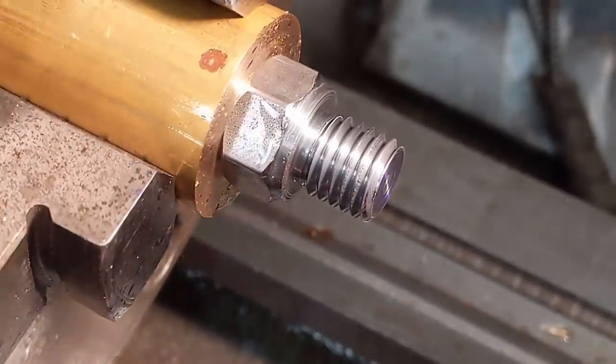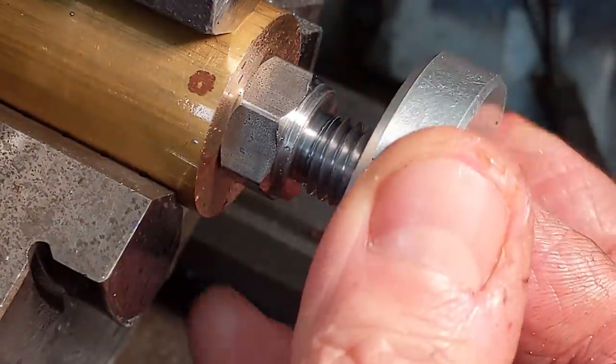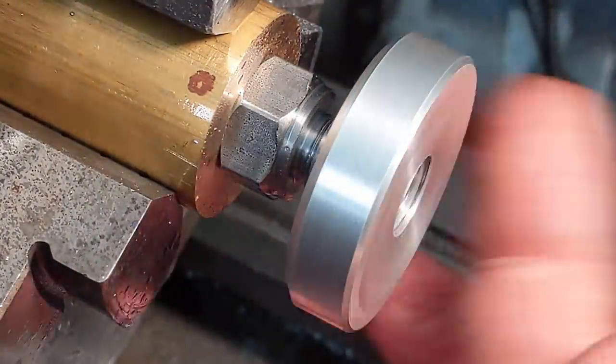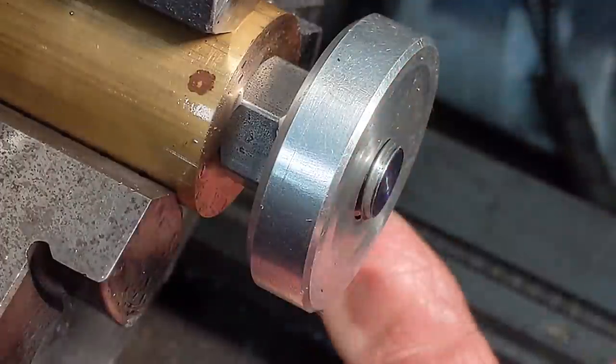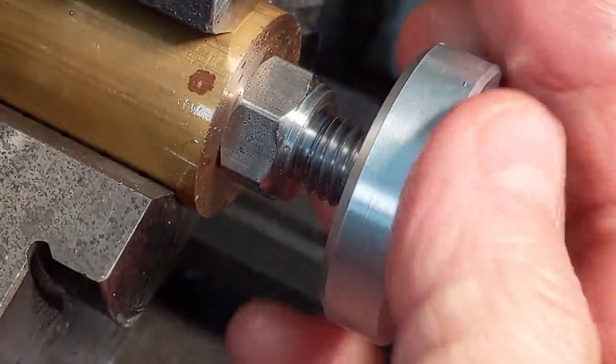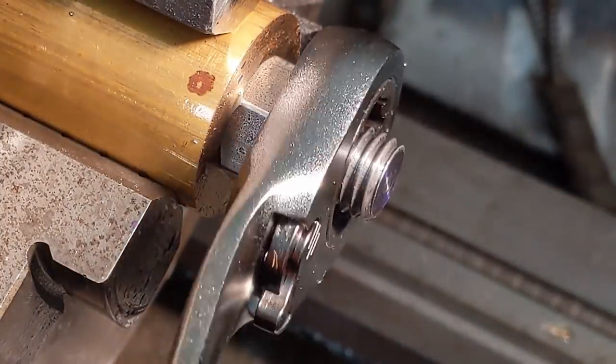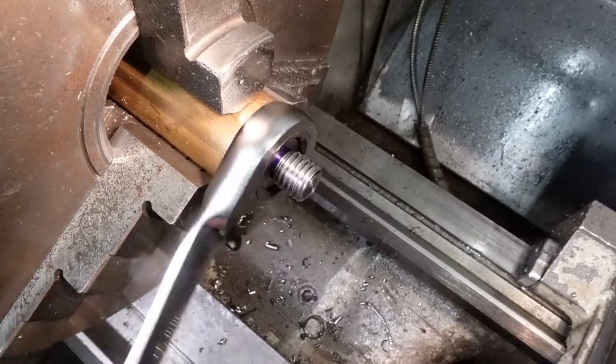Despite being a Joe Pyzinski upside down and backwards single point threading adherent, I can still cut a mean thread with the tool the right way up, using my spidey sense lightning reflexes to kill the feed before the tool crashes into the face of the workpiece, but not so early that it cuts a circle instead of a spiral.